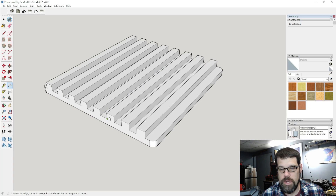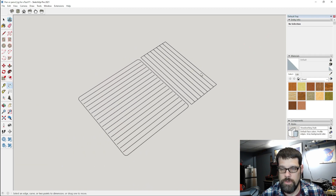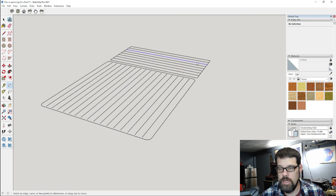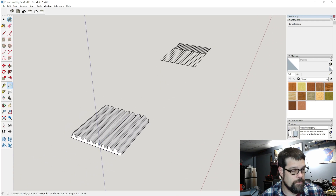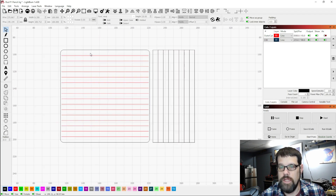This is a solid object for 3D printing, but I also figured out a way to break it up for laser cutting: cut out the base plate with etch markings as guides, then cut out the spacer shapes to stack on those lines. I've got that file ready for LightBurn or XCS. In LightBurn for our XTool D1 Pro 20W, the lines are set at 85/65 power, 225 mm/min for cutting quarter-inch plywood, with eight spacers to cut out.